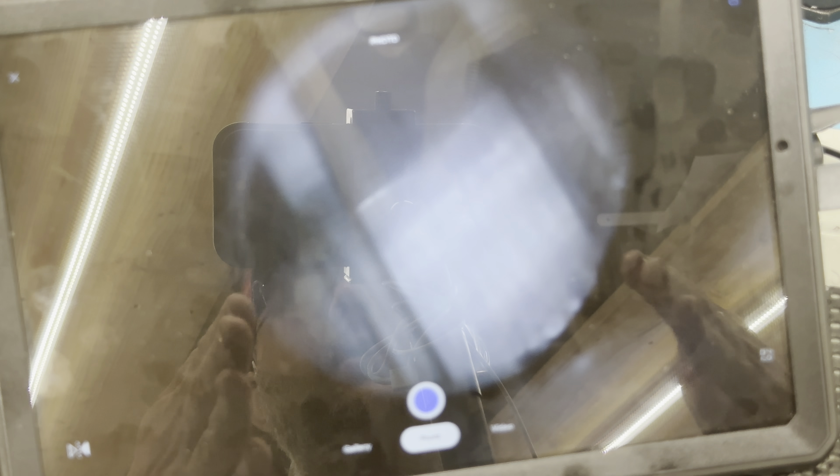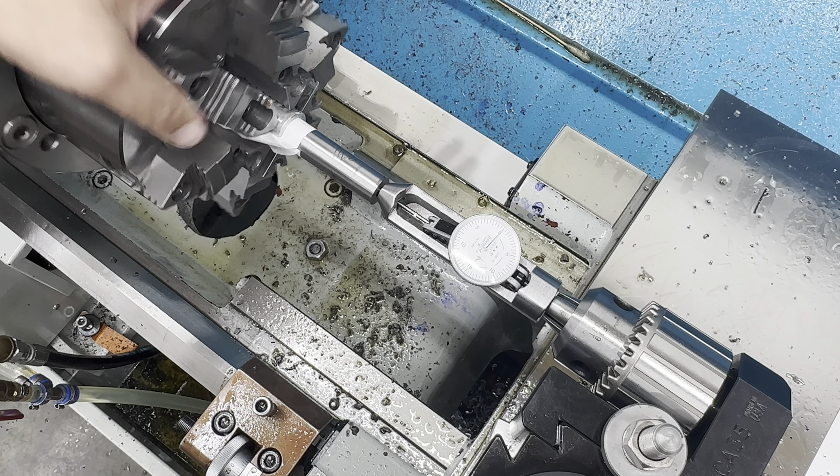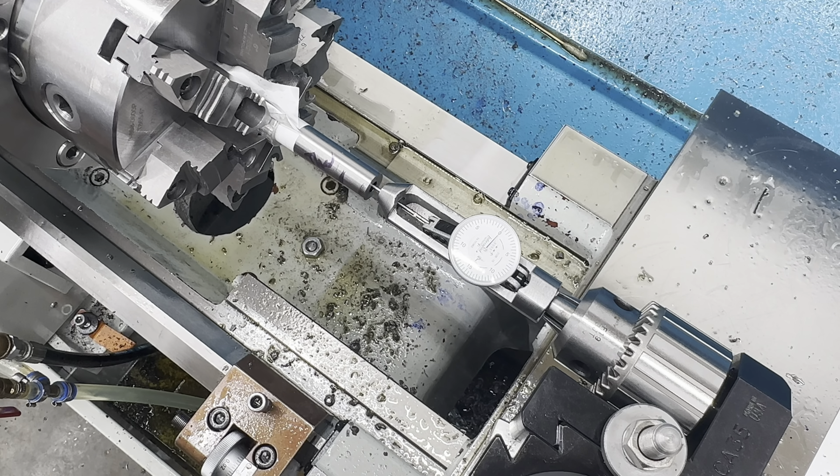There they are — these are your lands, the raised portions in the barrel. You can see all of them are cut the same length, so when the bullet goes into the bore it'll be going in perfectly. We did our job on the chamber. Next thing we got to do is the muzzle.